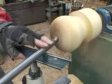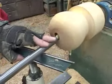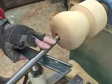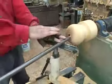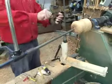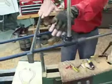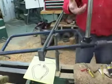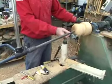And now we're cutting way over to the left. The swivel assembly is kicked over to the left, and the cutter is facing to the left a little bit. And look at the handle. What happens with the left hand cutting, there's tremendous torquing forces, okay? So now the D handle prevents that from torquing. It doesn't feel any different than the straight cutter when I'm making the cuts in there.